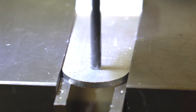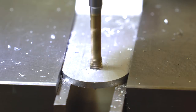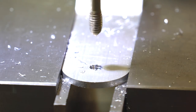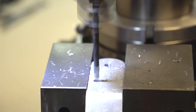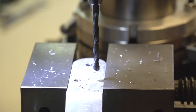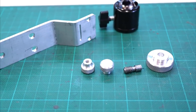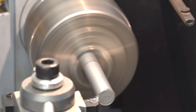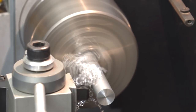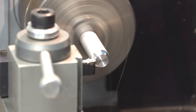Now I make a hole and thread on the end. I don't have a one-quarter UNF thread cutter, so I just use M6 which is a bit different. But there are just a few turns so the screw can't fall out. I also make 2 extra M6 threads on the holder — you never know when you'll use them. Now I need a screw to mount the camera holder on the monopod and the ball head onto it. First I make 2 grip screws for mounting the holder on the monopod.